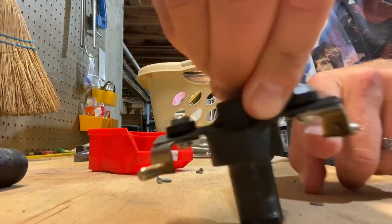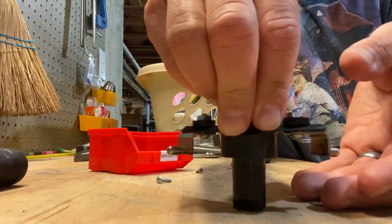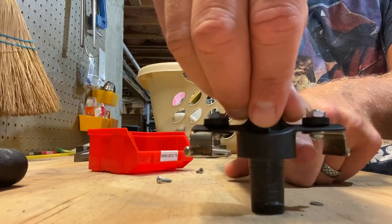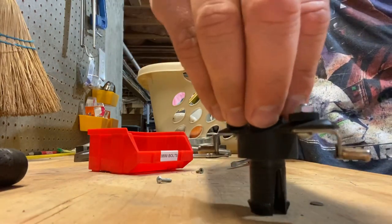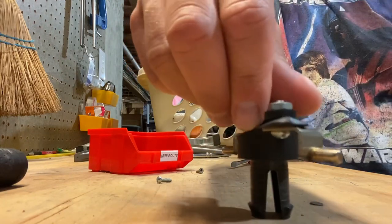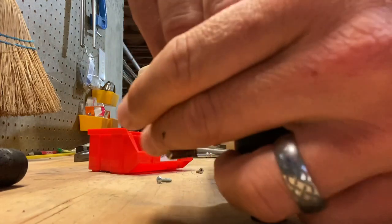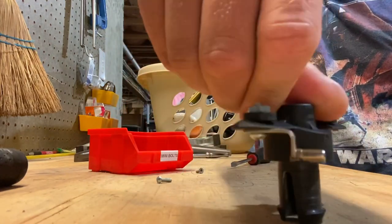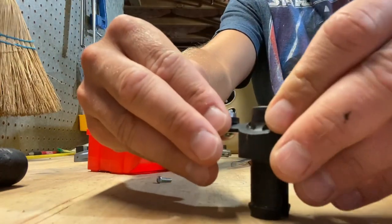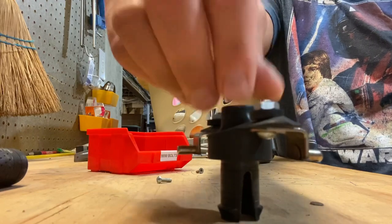The goal is that there's a gap right now — there's nothing happening between these on each side. With nothing happening here, the pellets are just sitting and falling by gravity, nothing is helping them through. This will allow a much more even flow. I still have a gap, but I think by having it pull — circling and pulling material in and down, keeping pellets moving along and shuffling through the openings — or pushing in the other direction, which might work better for seed. Or just set them straight to move product around. I've basically got three different versions to test.